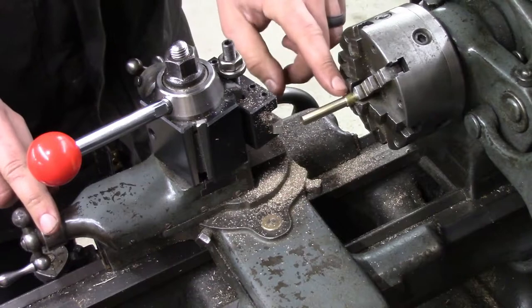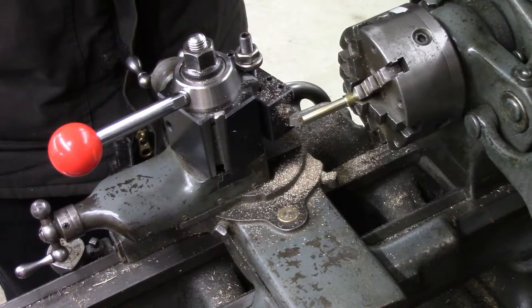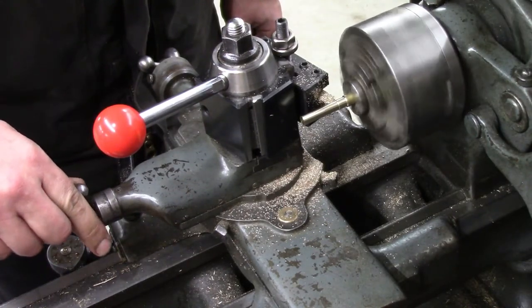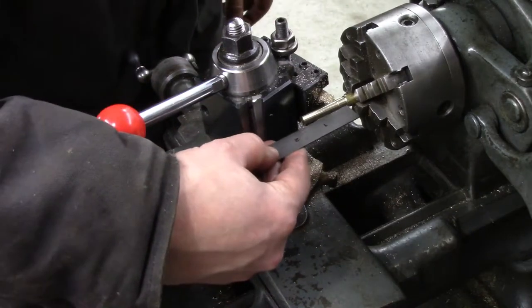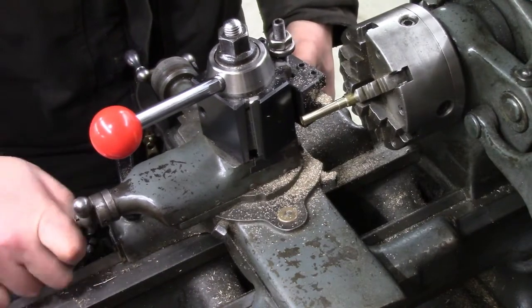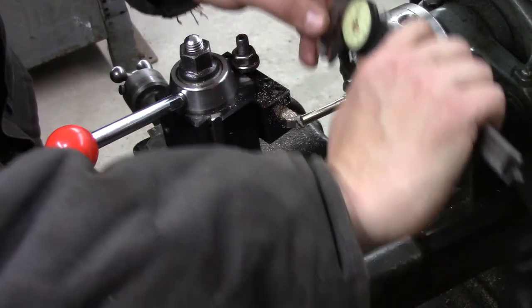So this step up here wants to be 1/4 inch long. Run this first off this top side just to make a mark at the depth and cut from there. Should use a quarter inch, which it does. Then come back, start using the auto feed. 249 is the number. I'm just under 3 right now.